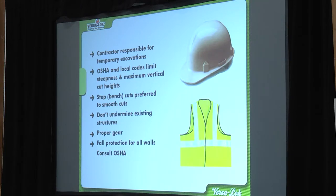Always be thinking about what your wall's holding up — whether it be a building or a parking lot. Think about that 50-foot oak tree you're compromising by digging out the base of. A pine tree, for example — dig too close and you're going to undermine the root system and that tree is going to fall on somebody. Think about what you're cutting into and what the soil you're removing is holding up. What is up will come down if you destabilize it.